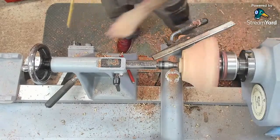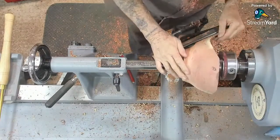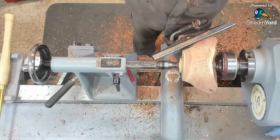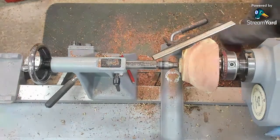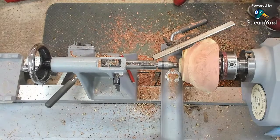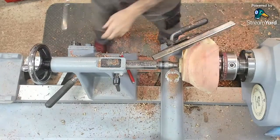Let's have a look at that now. I'm just slowly checking to see where we are shape wise. We'll have to lose a bit here, so we'll be a bit small. Well, maybe not. We'll just leave that natural bit in there. Yeah, leave it for the time being and see how it goes. It could be a pouring bowl. So that's a fairly nice cut in there. What we'll do is change gouges. I like that deep pinky red that's emerging. Get a nice sharp gouge. I think this one's sharp. And we'll try and take a nice little cut, just as a finishing cut across this.